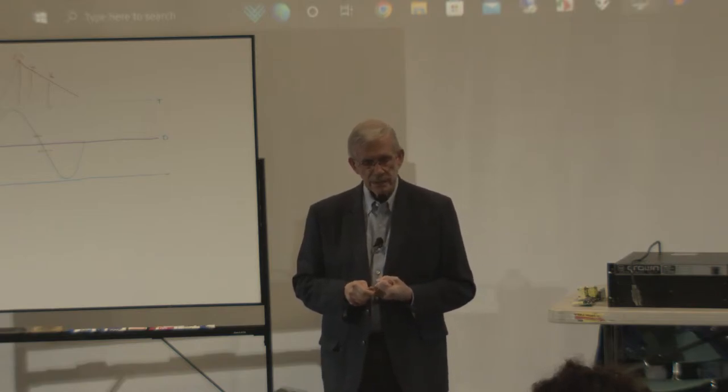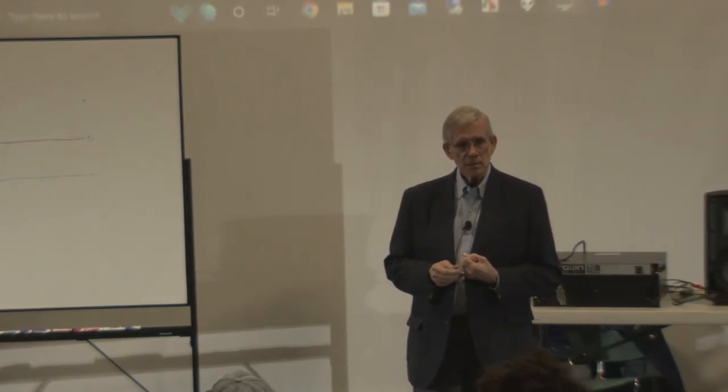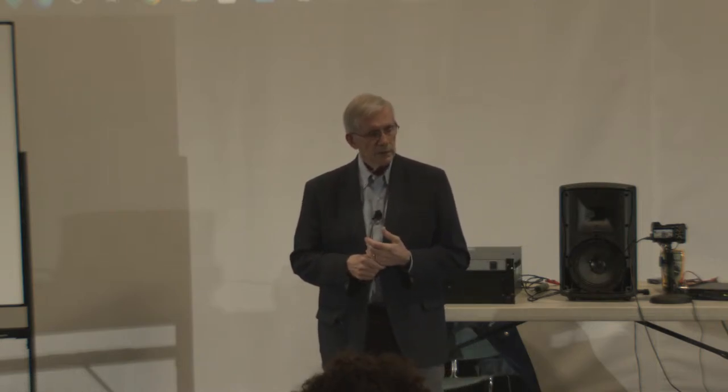Class B has a technical difficulty. There's nobody going to use it. Class AB is very valid. That's the best compromise for an analog amplifier that there is, and so you will find Class AB. The QSC CX series is Class AB. Trying to think of what else. I think some of the Crowns that you sell are, but the Powersofts are all Class D.